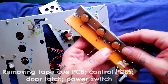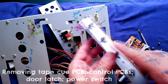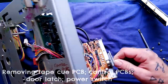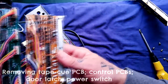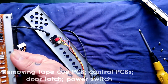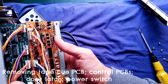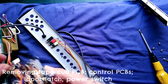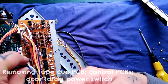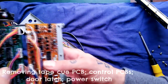I've removed those two screws, giving access to the tape cue board. I could remove that plate but it's not really necessary - I can adequately clean and lubricate these four potentiometers without removing it. The three screws I've taken out give enough access to lubricate the pitch control as well. I expected proprietary chips in here but it turns out to be Motorola and Mitsubishi integrated chips. The record amplifiers, playback amplifiers, and mixers haven't been consolidated into larger chips the way the control logic has - rehearsal facilities, memory, and so on tend to end up in one big chip, like you see in the 424 Mark 3.